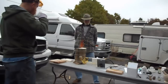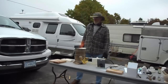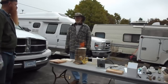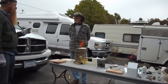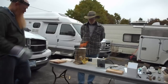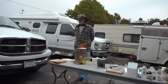We're all molten again, but we'll give it a minute. When you poured it, it looked a bit thick from behind. The flux was thick. What do you add to thin it? Borax. Borax thins it — the more borax will make it a thinner, runnier melt. But I think there's a problem with going too thin: when you're precipitating lead litharge, you actually don't want it dropping so fast. A thicker melt is important in certain situations. We're using pretty small quantities here.